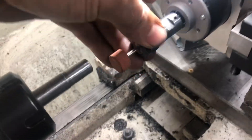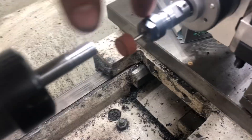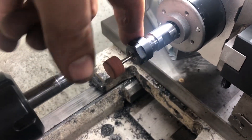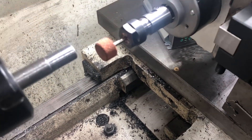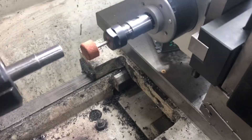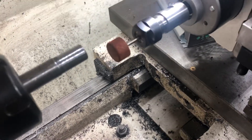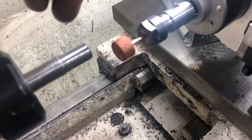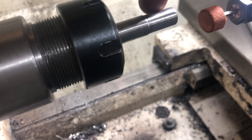It comes with the hardware, the motor, and the spindle nose, which is changeable right there. This is an ER11 — you could put an ER16 or ER20 in there, whatever you want. If you want to run a bigger grinding wheel, you put an ER20 in there and you can make like a 3/8 hub, which gives you pretty good strength.